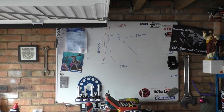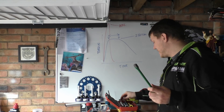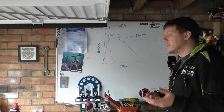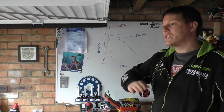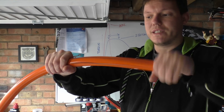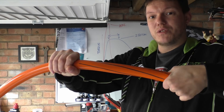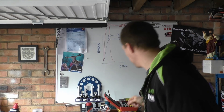How do they specify what that rating is? There are torsional formulas to calculate it, but basically the thicker the stick, the more torque it will transfer before it starts to deform and twist. That's all there is to it. The reason these sticks won't work with manual torque and have to be used with impact guns is because it's this instant knock. If you were to apply constant torque, it would just twist and twist until it applies more and more torque, until this actual bar yields.